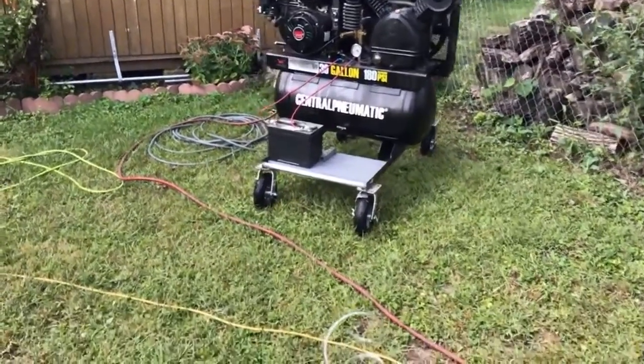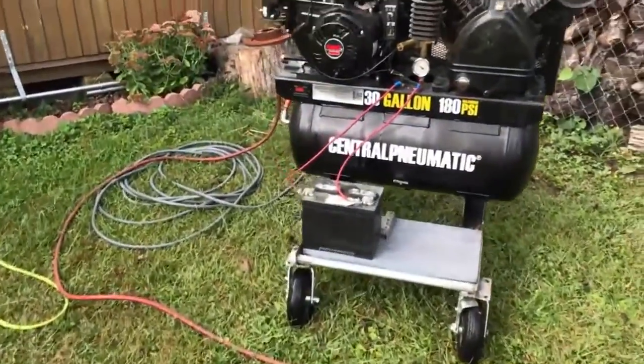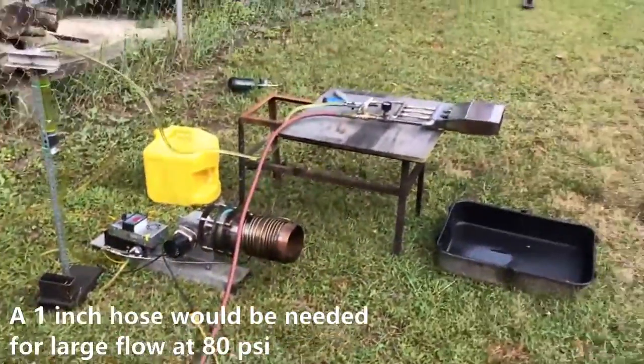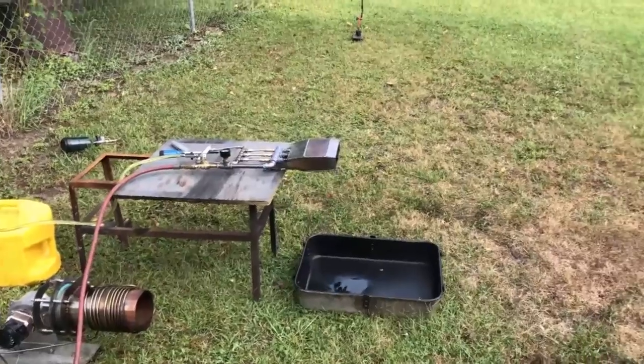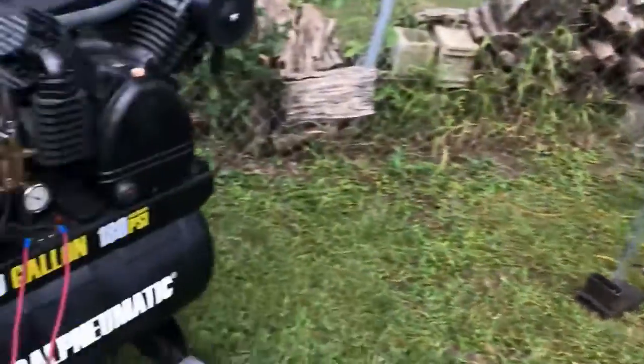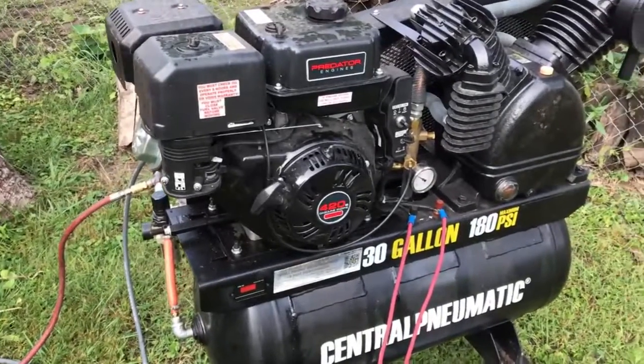We just had too much air hose involved. Even with this regulator set at 140 psi, we weren't able to pump the amount of flow that we're needing to see this thing run without a droopy flame. So we're gonna try that again.